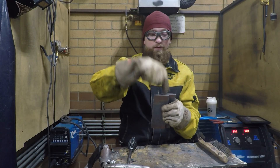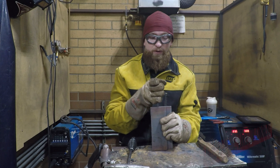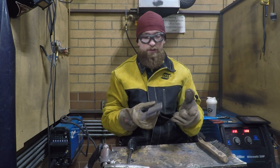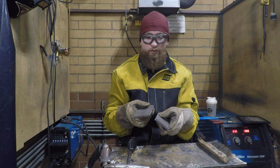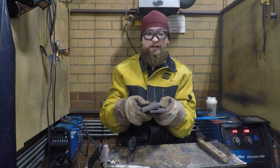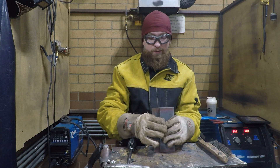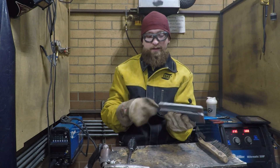We're going to tack with the welding gun on each end so we don't have to weld over the tack. If you bring your material in properly measured at exactly two inches, you'll get some extra credit points for being able to read a tape measure. When you cut on the shear there may be a little burr, so you might want to grind your tacks down so those burrs don't interfere with a nice tight fit-up. You really don't want to weld with a big gap, so squeeze them together about an inch overlapped, tack both ends, and set it down to weld.